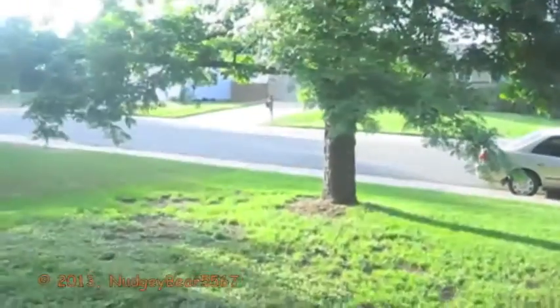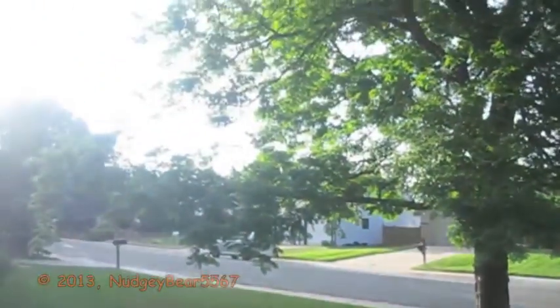You remember this one back here - this sprinkler was spraying onto the porch. I fixed that, I replaced the nozzle with the Hunter one that came with the Pro Spray. I replaced it with the MP rotator but I still had the nozzle laying around so I put it here. It's an adjustable arc - you just grab it and twist it to make it bigger or smaller. I made it 90 degrees so it doesn't spray onto the porch anymore. I'll do a demonstration of that after I'm done showing you all the ones in that chest.